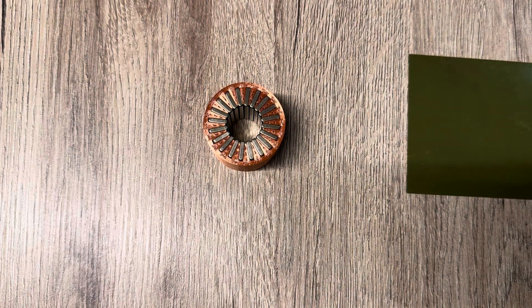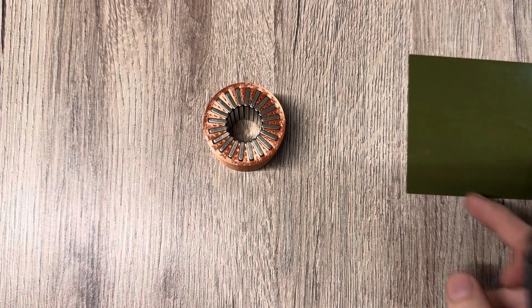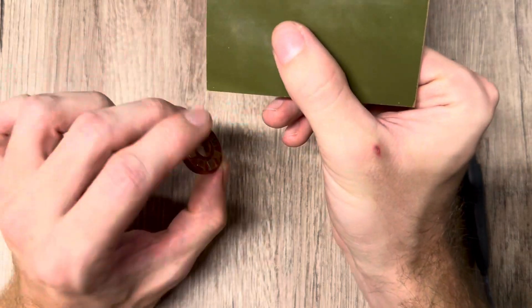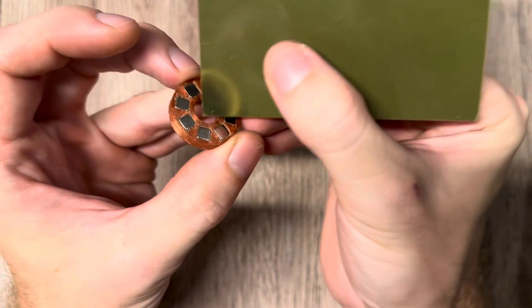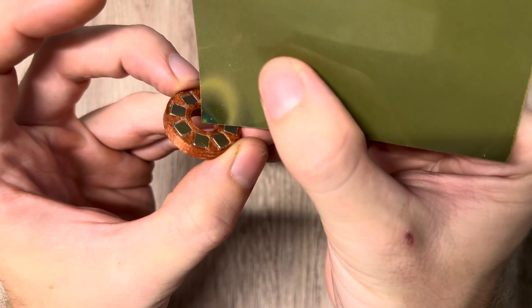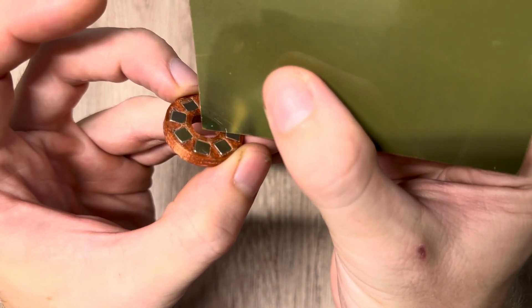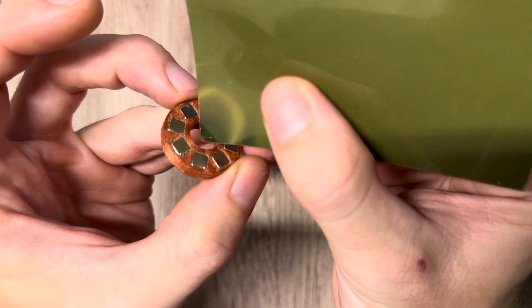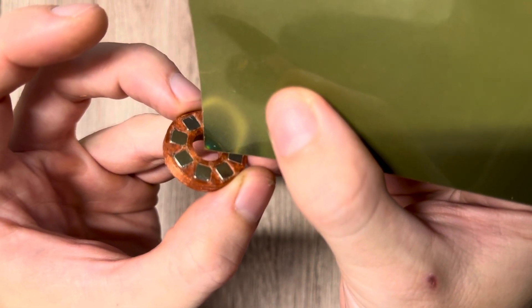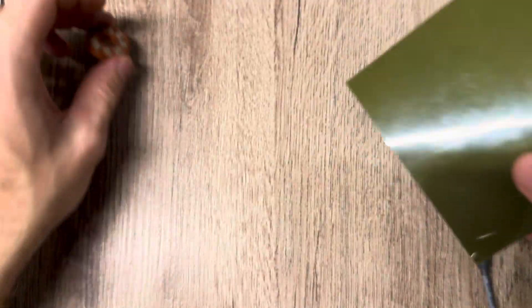Another interesting aspect is that with most circular arrays and all ring magnets, in the center we have zero magnetic flux. I'll first show you this with the small array and the field viewer — I can go in with the corner of the field viewer to the center point. Hopefully you can see the bright spot right at the corner — that's where there is no magnetic flux, the rest point of the field. There is no rotation, or zero magnetic flux at the center.